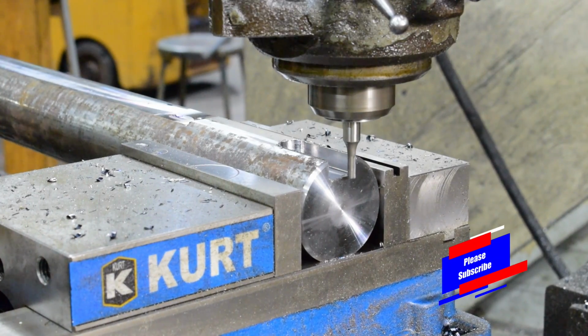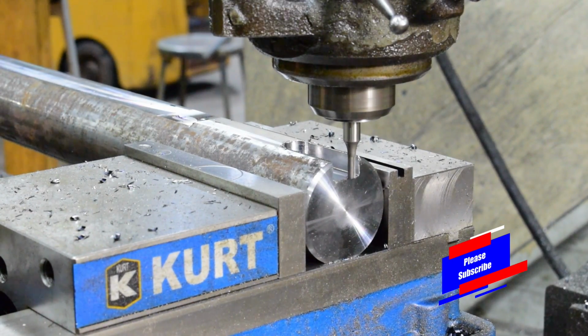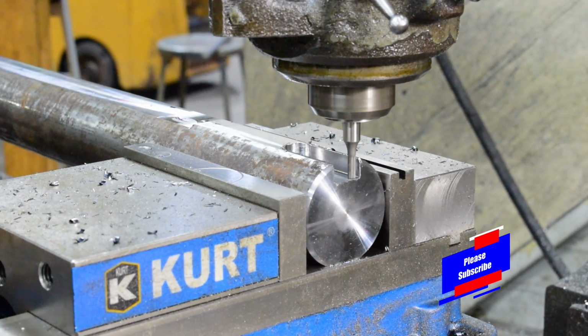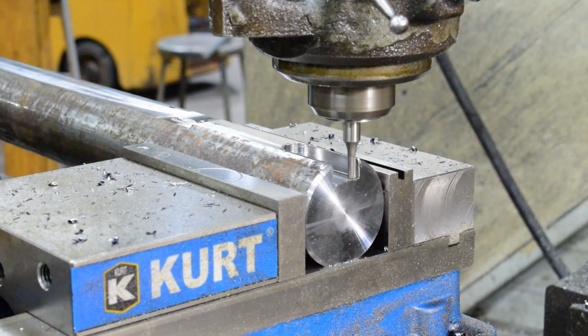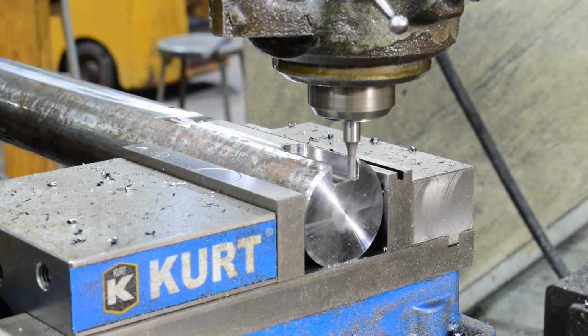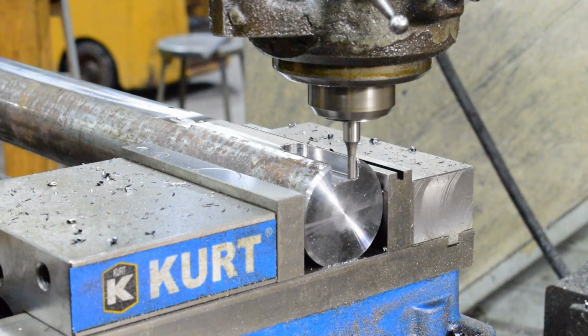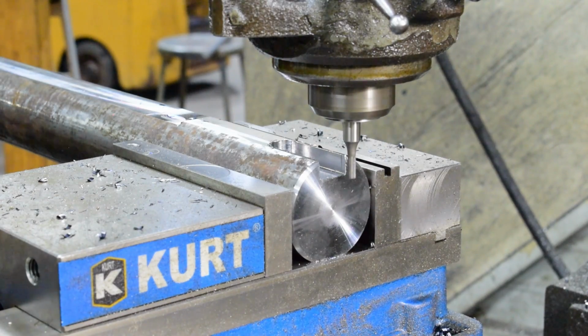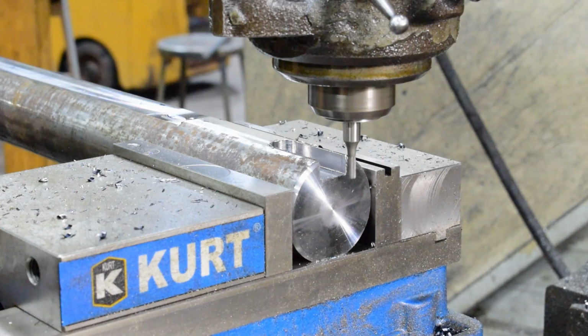And in theory, we shouldn't cut, and we're not cutting. Perfect. So we'll bring it in and touch it off. And that cutter left a little radius in there, down in the bottom. Actually, it didn't even cut perfectly straight. So I'm going to start out a little less. I'm going to start at 260 and we'll go ahead and see where we're at.